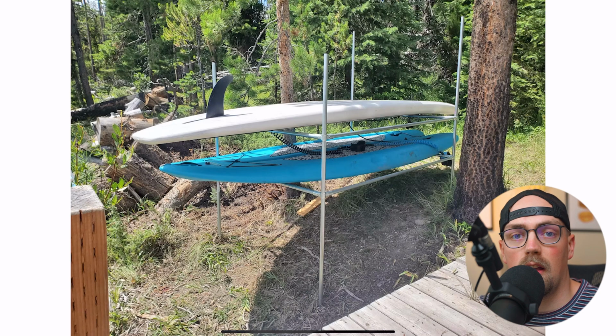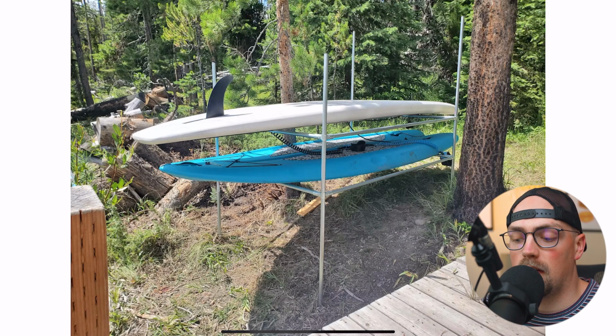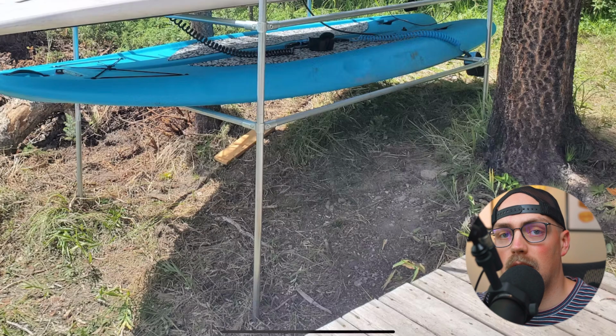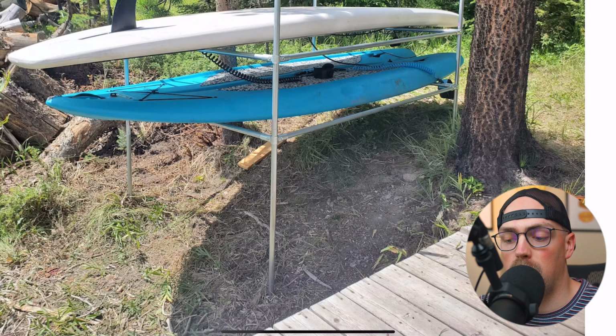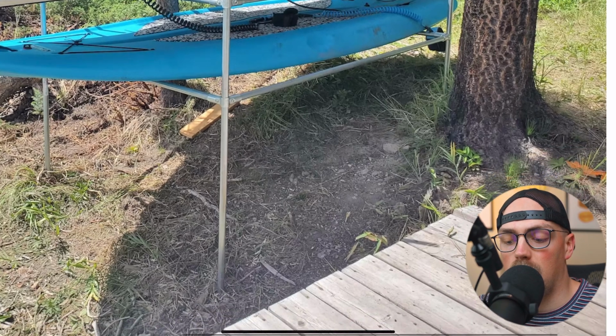So if you're looking to build a custom rack just like these, then you can get some inspiration for your projects. This first one comes from Ed and Lucy, and this is fantastic. It's a really simple one that highlights the use case of EMT conduit for something like this: it's built on a hill, which means it has varying dimensions, and you can customize the dimensions of EMT conduit really easily using just a handheld rotating pipe and tube cutter. Ed and Lucy just built these verticals to be different heights based on the hill.